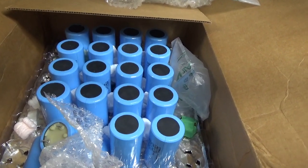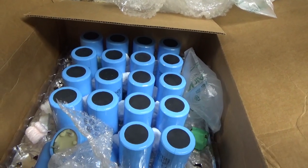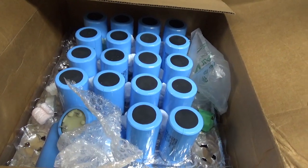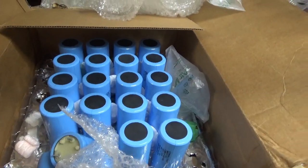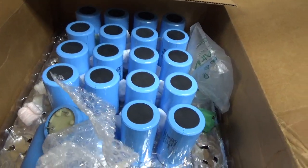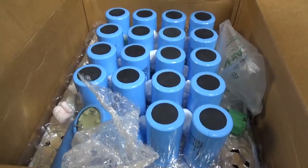I'm going to use those for the line connection. I only need 240. I'll have a ground and use a lug for that, and then I'll have the two hots. The transformers are going to be external on a cabinet, which I'm going to show you right now. It's probably going to upset people, but it's a really nice cabinet and it's built really well. My transformers are 151 pounds each and I'm using two of them.